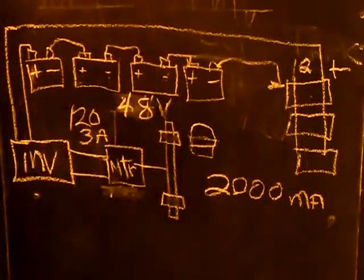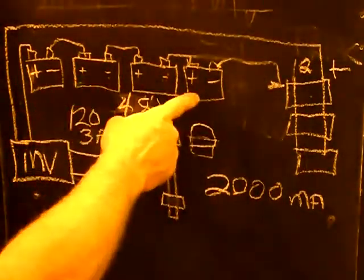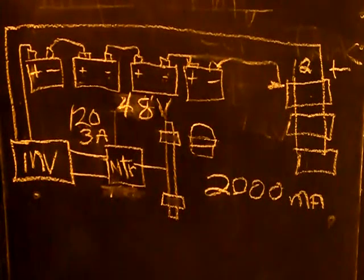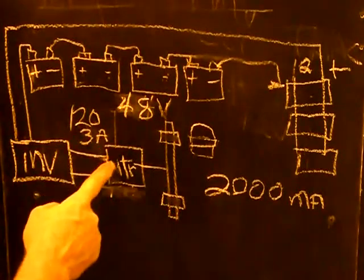The ones that I have are the big batteries for like the 3-wheel carts for people who are injured. And when you go to the Walmart, you'll see these batteries. Well, each one of those batteries connected in series like this, each one could provide, could run at 10 amps easily. And it might not be quite within the C20 rate, which is important, but it would make the test. Okay, so we got 36 volts and 10 amps finally coming, but we need to pulse it, and that's what I was saying.